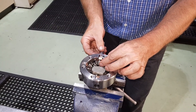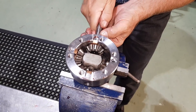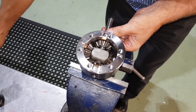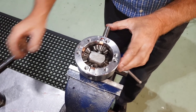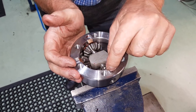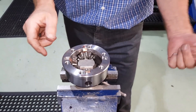It's quite a tight, snug fit in there. Push the pin through the thrust washer and through the planet gear. Make sure you've still got this in line — it needs to be at 90 degrees. Gently push it in and it'll locate on the thrust block. You might need just to lightly tap it. Once tapped in, push it through; now it will locate on the next planet gear, through the thrust washer and into position on the other side.